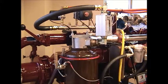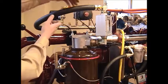The oil and air, the oil mist that's trapped in the air, travels through the upper portion of this tank where it's stripped out using these separator filters, and then is returned back into the system through a vacuum port on the back side of the air compressor. Now, first, to access these filters, you'll need to remove the discharge head.